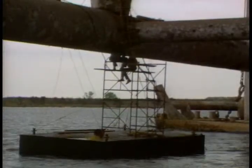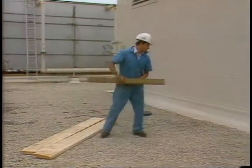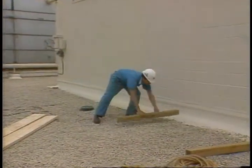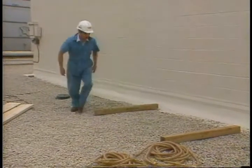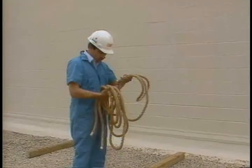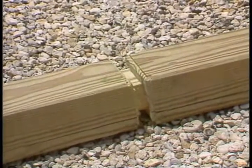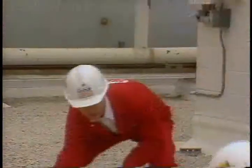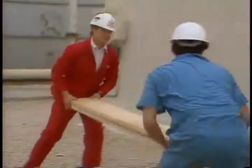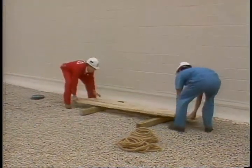You're going to need a couple of 4x4s and at least two 2x8 or 2x10s that are about 8 feet long. Hardwoods are recommended, and thicker boards certainly are not discouraged. The rope should be 3/4 to 1 inch thick and in good condition. The 4x4s, which are called bones, should be notched so that the rope will sit in the notches. To start with, place the boards on the deck so that the 4x4s support the 2x10s.